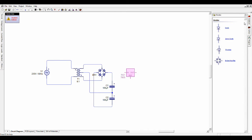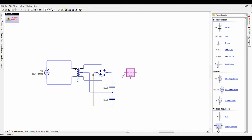And they're not best for precision power supplies either, but we're just going to roll with it today because we don't have any switch mode power supplies or some of the more precise linear regulators as well. So you just hook up the reference voltages to your 0 volts. And I'm just going to flip this around, mirror, so that the inputs are both on the same side and the outputs are both on the same side as well.